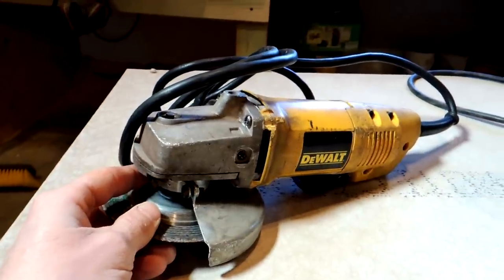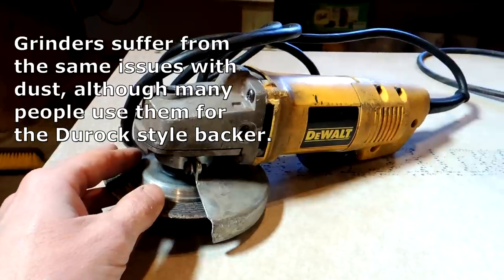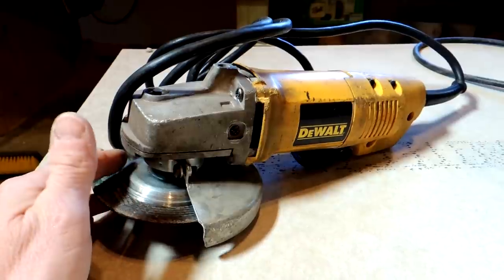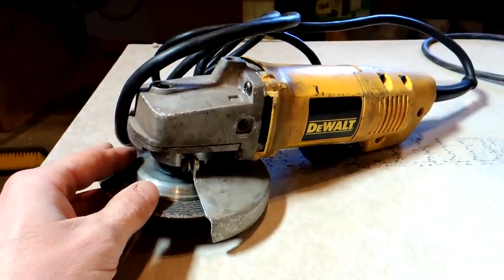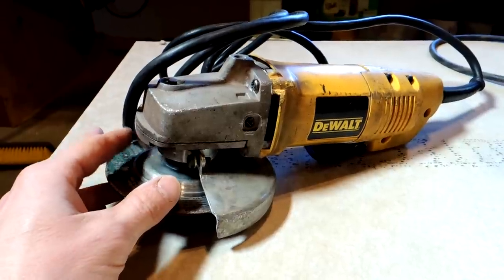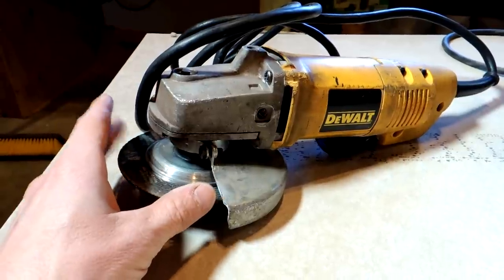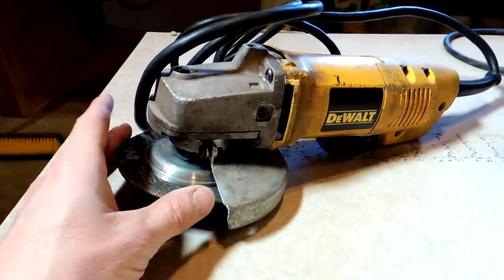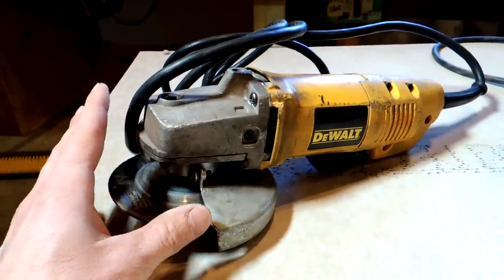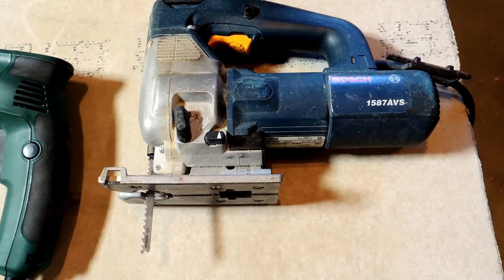The third method is to use a grinder, like a four-inch grinder fitted with a masonry wheel. Again, you're going to create a whole bunch of dust, so I really don't like it because of that. Some of the other brands besides Hardy Backer, you may be forced to use something like this — especially the crumbly brands where you need something spinning fast for a cleaner cut, and a grinder may be the answer. But as far as Hardy Backer, I don't recommend it. It creates too much dust and it's also a slow method.